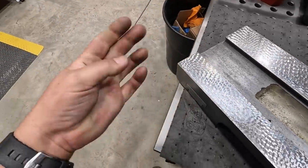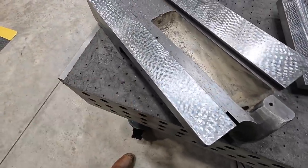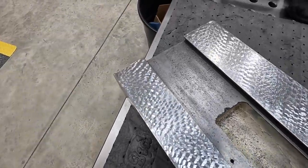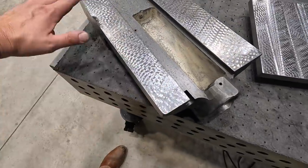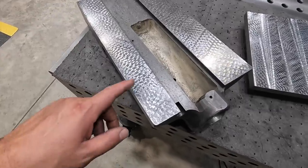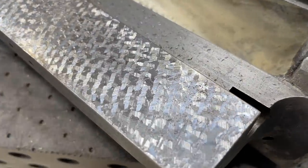So like I said, we're taking approximately 2/1000ths out of that every time it comes down and hits it. So what we'll do is we'll clean it and we'll hit it with our flat stones from here, you have to stone it to get rid of the burrs there.